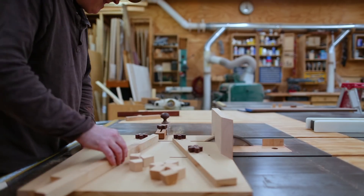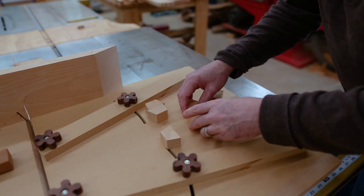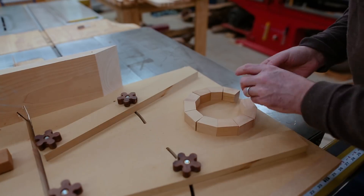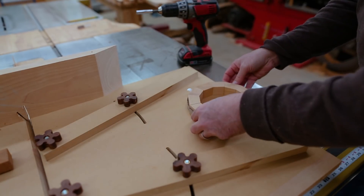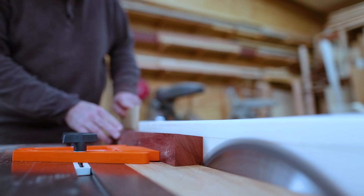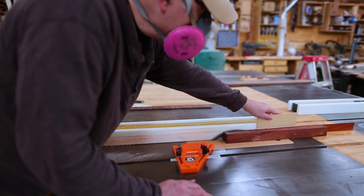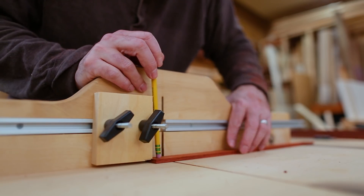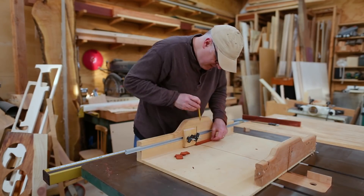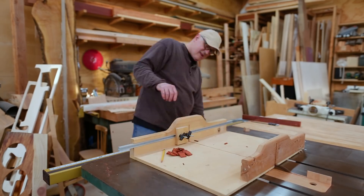It's just a matter of doing a drawing that gives you the relationship between the length of the segment and the size of the ring. You can see I'm going back and forth between the two fences — I'll usually do the first one, put a clamp around it, and check if all the seams are tight to verify my angle was right. The football is divided into four panels with a seam between each, so I cut some darker wood — I think this is padauk — into very thin strips.